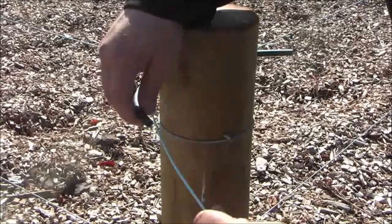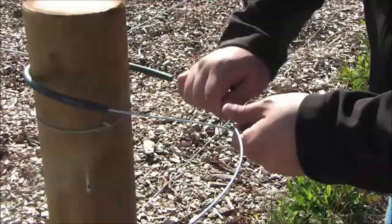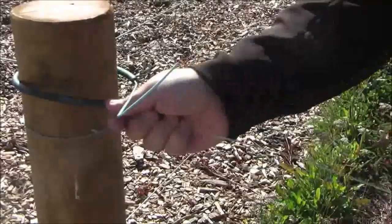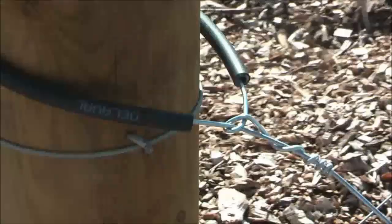After that, thread the wire through the insulator and again make the same simple knot: place the wire over, go between, get the wire, bend it through, make a handle in the end, tighten the wire to the post, then make a loop and finish up with some tight wraps.